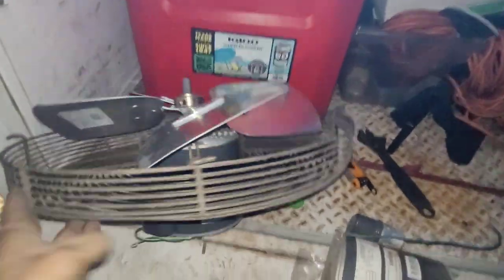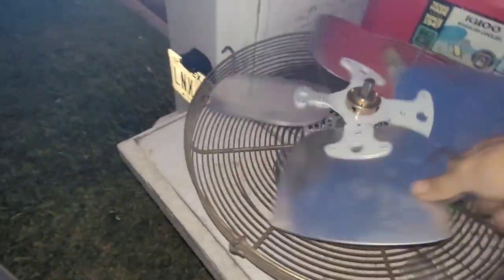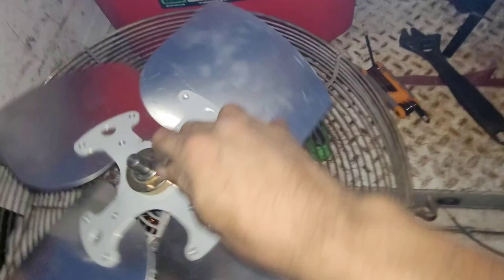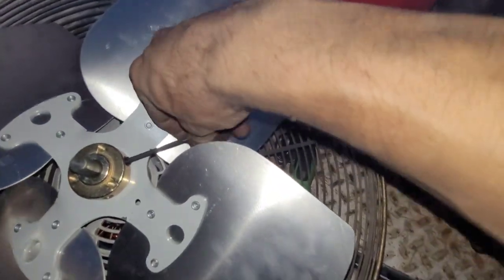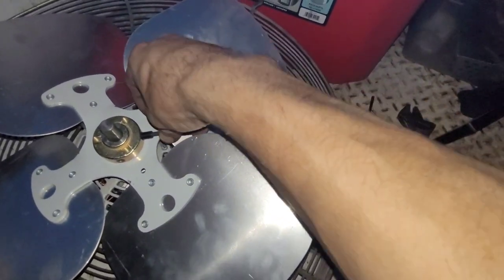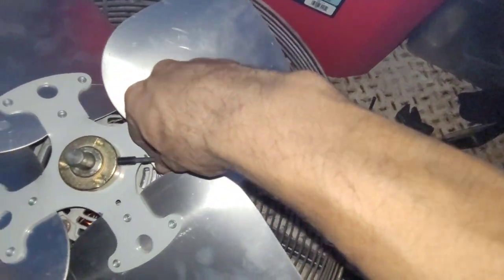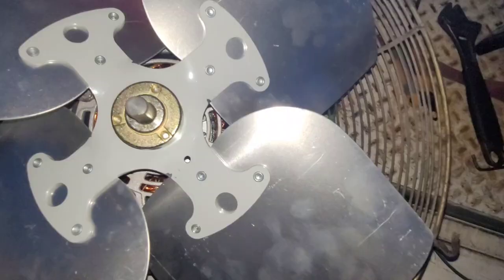This is it — motor, blade mounted, new motor and blade with a new hub. It's ready to go up on the unit. Make sure it's nice and tight. We actually do not need this set screw because it's not going to hold on to anything, and if we tighten it, it'll just scar the machined part of the shaft and make it very hard to remove.